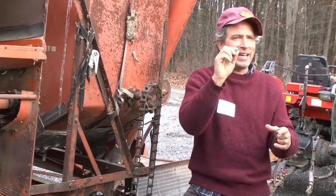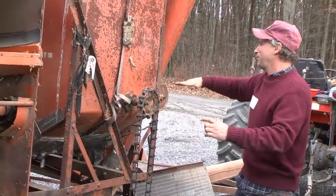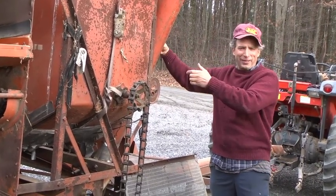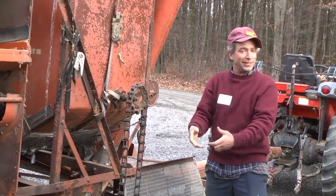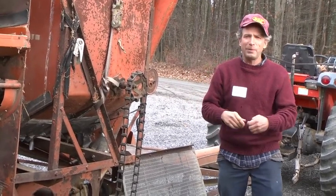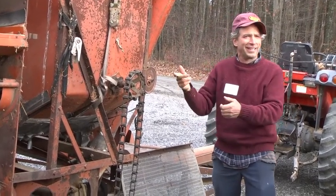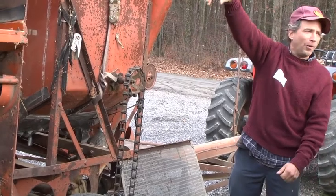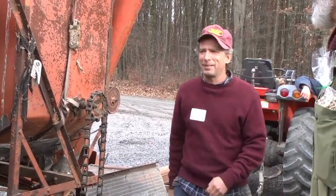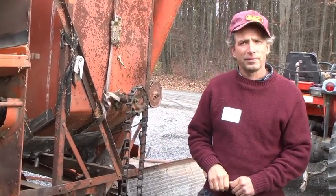It'll take Timothy seed, any small seed goes through that scour cleaner, and then there's usually a bagging platform that comes off of it, so you can bag off the scour cleaner either weed seeds so they don't go back in your field and increase your weed seed bank, or we used to combine Timothy with this thing and have it all go up into the scour cleaner and use the scour cleaner to take the Timothy seed out. They're pretty cool.